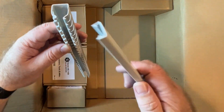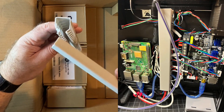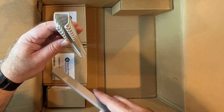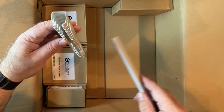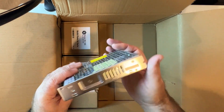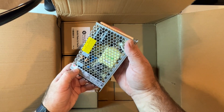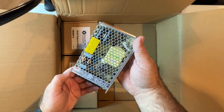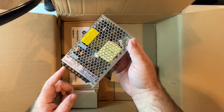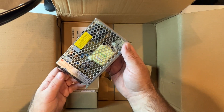This allows you to have very nice wiring management. It will be mounted on the back of your Voron, and then your wires come down through here and you just pull them off as needed into either the Raspberry Pi or the main board. In here we have the power supply — I believe it's a genuine Meanwell — a 150-watt 24-volt power supply. That's more than enough: you're going to be powering a DC bed which is about 60 watts, plus your hot end and main board, so there's plenty of headroom.